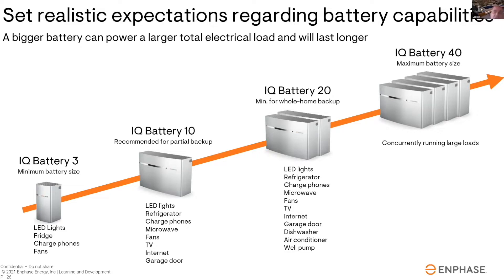What's the difference between sunlight backup and the 3k battery? With the IQ Battery 3k, you get two major benefits. The first benefit is: if you're on sunlight backup and a cloud goes overhead, you're losing power — remember, you have no stored energy. The only energy being provided is what's being generated by the sun, so if the sun goes away your power goes away. In San Diego we have a lot of sunny days, but in the Northeast I'd be more conservative about sunlight backup, whereas in Texas or Florida I'd be more aggressive.